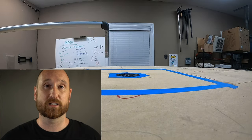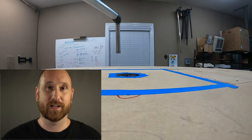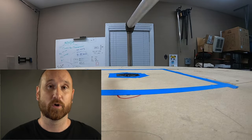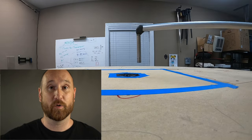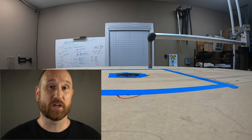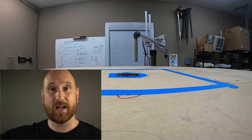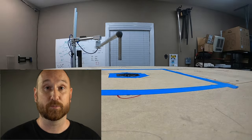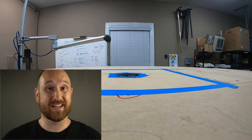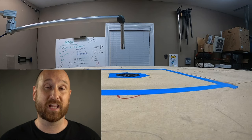All of this data was captured using my Klippel near-field scanner in the horizontal baffle configuration, which makes it super easy and accurate to get anechoic data for pretty much any driver. This is on a four-foot diameter baffle. The cool thing about this software is it understands where the baffle edges are, so it can mitigate the effect of the four-foot baffle edge and provide you the data as if the driver was on an actual infinite baffle.